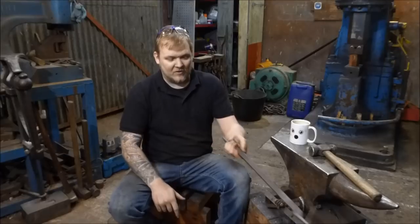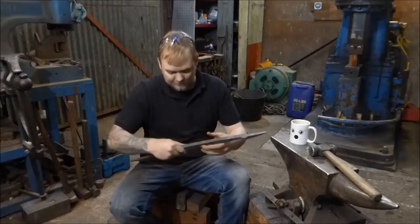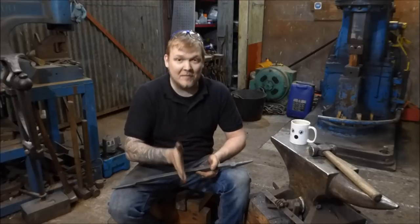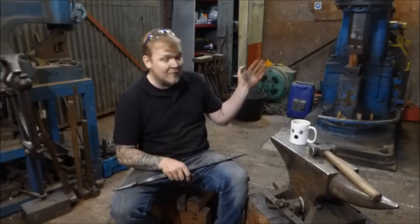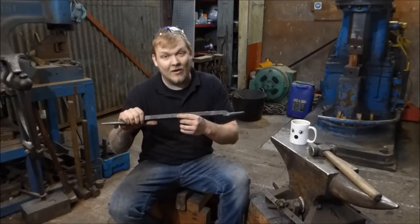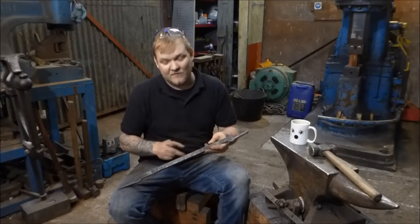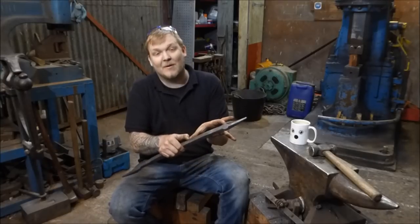You can't — well, you can, but what that would involve is poking that end in the fire, pulling it out and then drawing a bit out here while it's still attached. I'm not going to do that. What I normally do when I make these tongs under the power hammer is I leave them at 250mm long. The power hammer allows me to draw the material out leaving it quite thick across the whole length, making nice chunky reins. Unfortunately I don't want to draw out all of that material, so I'm going to cut an extra 50mm off — an extra 2 inches either side — and forge the reins out of that much material.